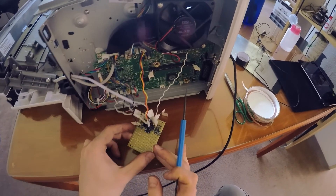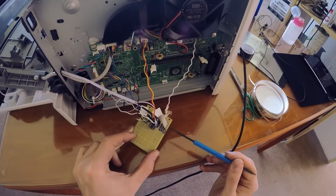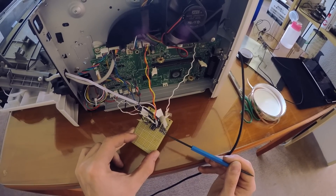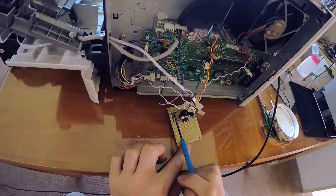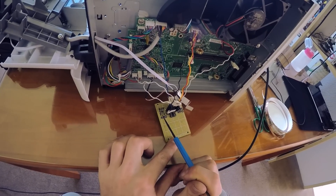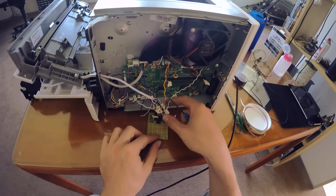The modifications have all been documented very nicely by Instructables user M. Lerman, so I'm going to keep this very short and post a link in the description. This is an 8-pin ATtiny microprocessor on a piece of protoboard, and it is responsible for simulating all the sensors that have been removed — specifically emitting the write signal at a certain time after the notch in the carrier has passed the optoelectric fork sensor.